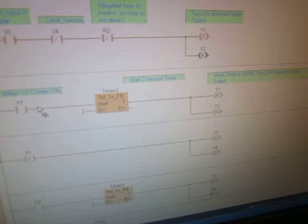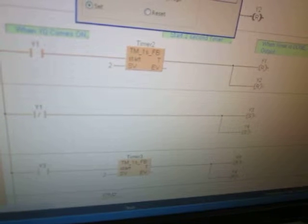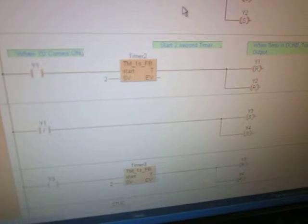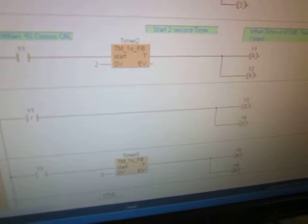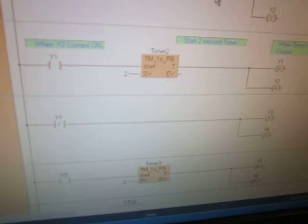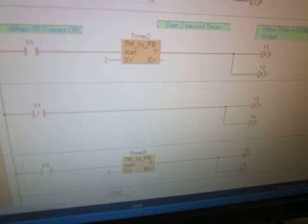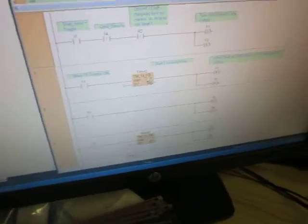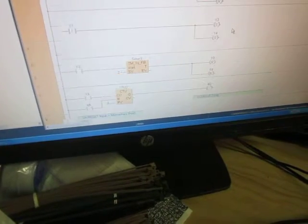Now when it comes to the input sensors, you only really need one sensor to tell the function block that it's done its job. So I'm going to set this back to set. Even though you might have multiple sensors hooked up on the individual actuators, with the actual water valves there's no sensors. So it would just be this relay on, this relay off, this valve on, this valve off. And you just follow it, and it reads like normal, left to right, top to bottom. So after it turns this valve on, and sets the contact, says okay, this works, does the timer, leaves them on, turns those two valves back off, and then back and forth. So it's exactly the same as the other one, only you're branching off.